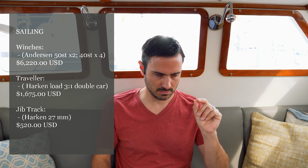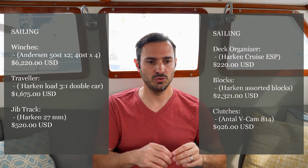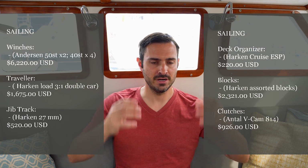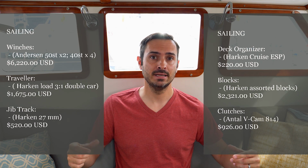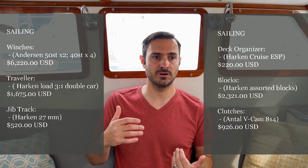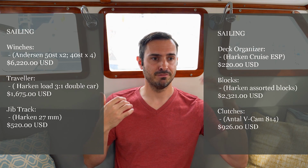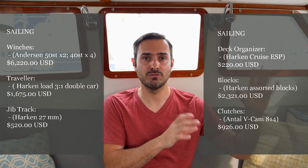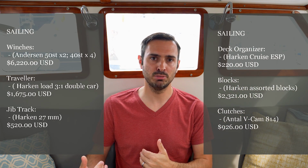Traveler, Oram deck plan. So we went through and used the deck plan. The deck plan actually has all the numbers, the model numbers for specific items that are recommended. And how he arrived at that number is by using your main sheet load. So you can figure that out fairly easily by 40 knot winds. If you accidentally had the full main up in a 40 knot wind, what would be the load on the end sheeting position for the boom?